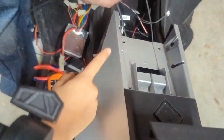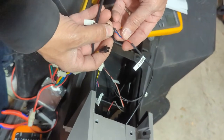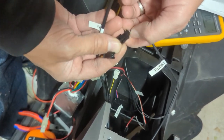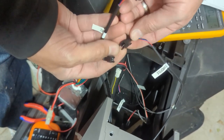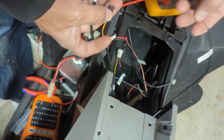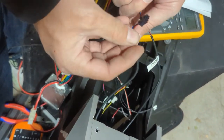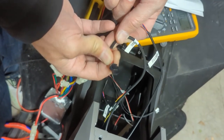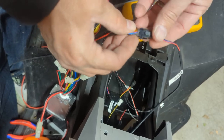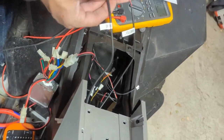I'm trying to go through this quickly. Throttle is the female — male connector with a little clippy on it right there. So that's red, blue, and black — throttle, got it. Not to be confused with brake. Okay, brake does not have a clippy. Those will go together — but throttle on brake would be weird. That's going to be the brake.